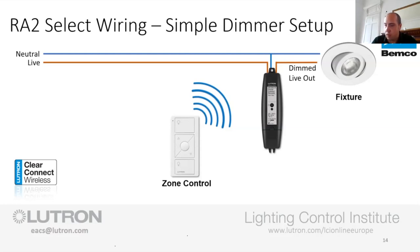If you look at some of the older technology that we had as well, fluorescent switch start had an inrush, and metal halide got even a bit worse from that side of things. Metal halide used to be about 10 times the running current for inrush. LEDs can actually be nearly 100 times the running current for inrush. It can be quite horrendous. I think things do seem to be getting a bit better though. When the LED lamps were initially brought out, they weren't spending a lot of money on the power components at the back of the LED. All the money was put into the actual LED chip because everybody was fighting on cost and driving that down.